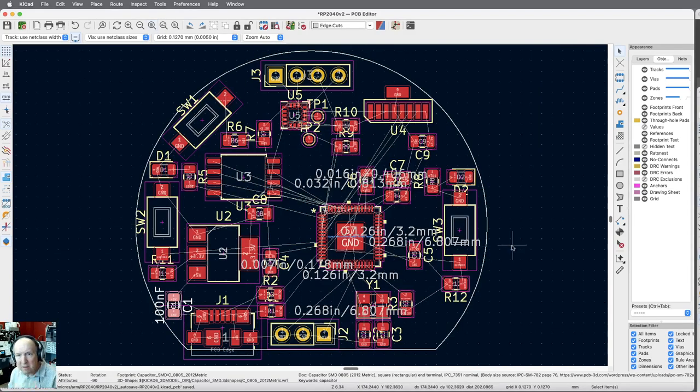This is a tentative layout of where I'll put the parts — I'll adjust as I go along in the final version. This is a good starting point. I'll probably start in the lower left corner and work my way through, or start at the micro and work outward, making sure to take care of all the rat's nests as I go. Let me save my work, and I'm going to break the video here and we'll start again in a few moments.